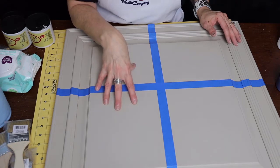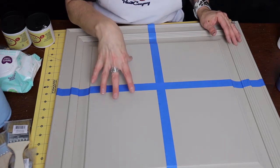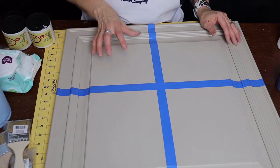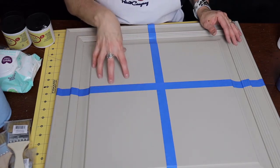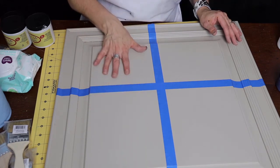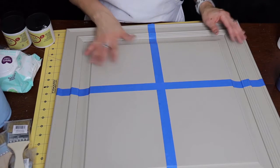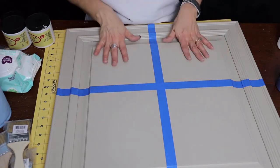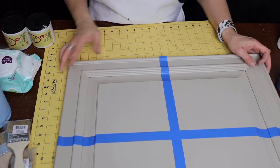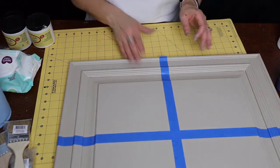You can do it without the clear coat — just know that you're going to have a much more dramatic look, and it's not going to move as easily because your paint is going to absorb those colors right away, so you'd have to move quickly. But I like to use a clear coat in satin before I do my glazing. I've got this board separated into several different quadrants, and that's because I'm going to show you something different in each one. Up here, I'm going to show you how to bring out the details.